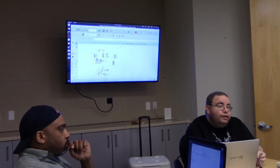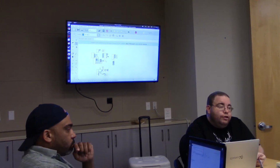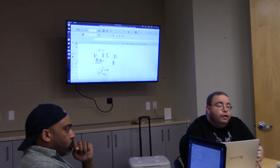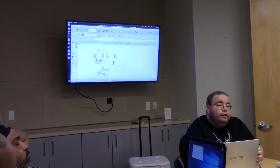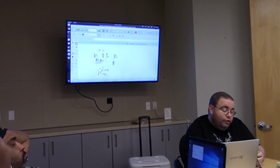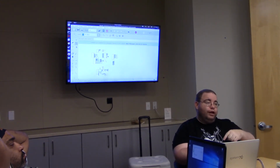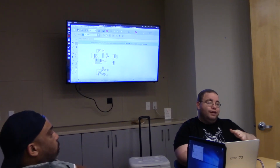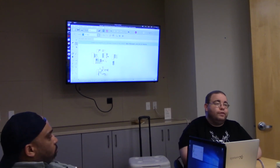The real problem here, and what I didn't get to last night, I really wanted to have a demo where I could show this thing displaying an image. And what I didn't get to last night was displaying an image because of that writing thing. The writing clock is not necessarily the same as the video clock, because this is going to be used by a computer on a separate asynchronous clock. This is a peripheral device. If they were tied together, then it would be pretty easy to do. Because they're not, I need to make it where you can theoretically write a value to a buffer somewhere in block RAM, and then during the next time that it's possible to write something, write the next thing out of block RAM, and so on.